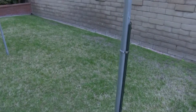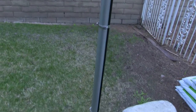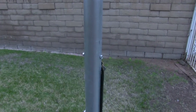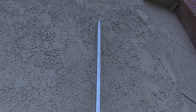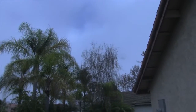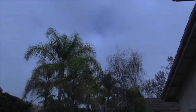So what I'm going to do, just to test this thing out — I haven't quite got it pieced together yet — but I'm going to put on this pipe here. It's about five and a half feet tall. I'm not going to mount the antenna on the pipe, but I drilled a couple of holes and put a couple of beefy screws right through the bottom of it. I doubt that'll pick it up, but then I'm going to fit another piece of this galvanized conduit — a ten-foot hunk of it — and stick it up inside there. That'll get me about 15 feet in the air at the base of the antenna, so the antenna will be about 32 feet straight up. I think I'm a little worried about these palm trees — probably won't be able to transmit through them very well.